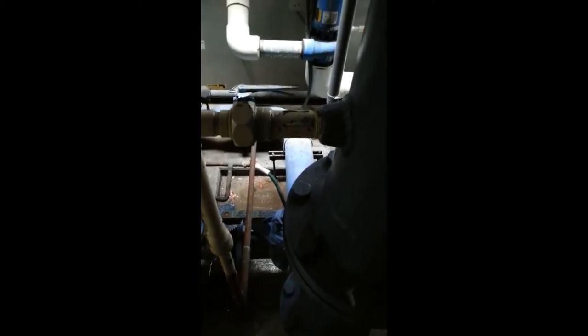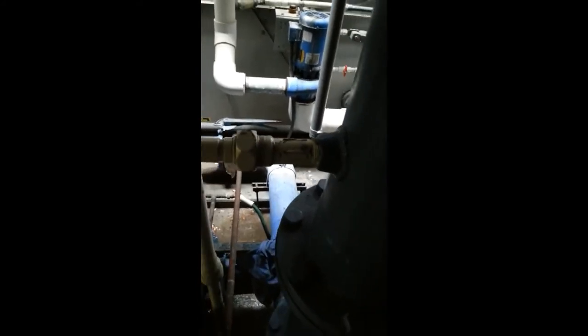So I have a box full of parts here. This is a steel pipe and this is a copper pipe, so a dielectric union is necessary — some form of that is necessary. But in this case I'm going to use the 6 inches of brass method here, so I can put a brass nipple and a valve and then a union and then a copper pipe. We'll achieve the same thing except we'll have a valve that's able to isolate this whole line set here so we can work on it.